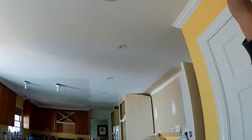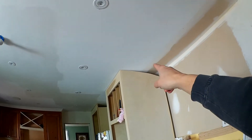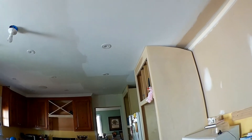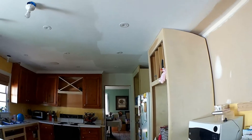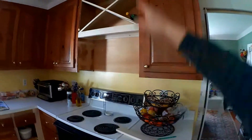So I got all these lined up and ran my patterns. I had to do some measuring of what the distance was going to be from each of the cabinets and kind of laid that out — how far apart they should be. There are some resources on the internet that show you what the distance ought to be away from your cabinets and where it should fall on the actual countertops, so that the light shines there and you don't have shadows with your head when you're looking down at the counter. So I had to measure all that out and created all my little X's with pencil and chalk line.